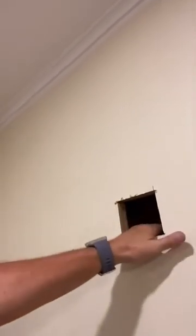The next step is we have to find out in the attic where we are. This cell down here where this outlet is, that's in a different spacing. I need to find above here — I'll look at the wall, measure over, or use my arm as a reference — and then make a hole above in the top plate. We'll get the wire down in here, and also some low-voltage internet cable for Netflix or whatever.